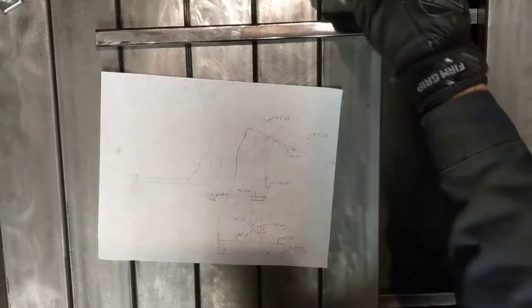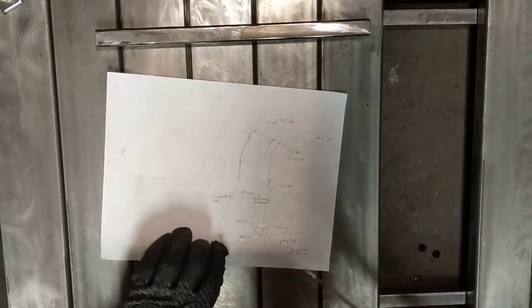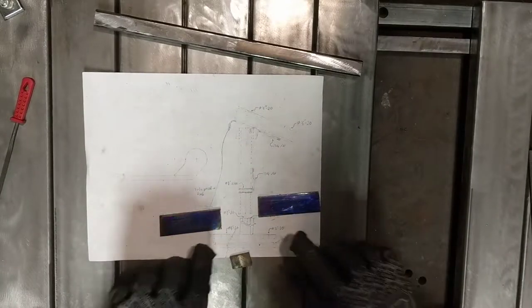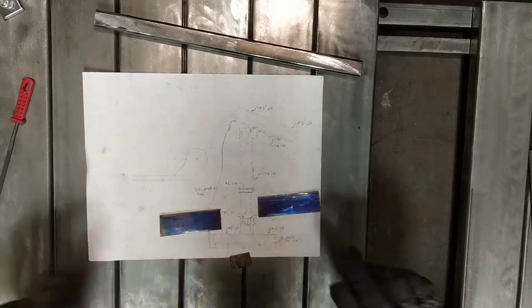We're going to start by building the base of this clamp section that's going to slide into the slats of the welding table, so you can move it wherever you need it. And I'm just going to use the material I have in the most abundance, which is 3/16 by 1 inch flat bar, and cut out these three pieces. Okay, got these to size, and what we're going to do is lay out these 1/4 20 holes right here and shoot them through.